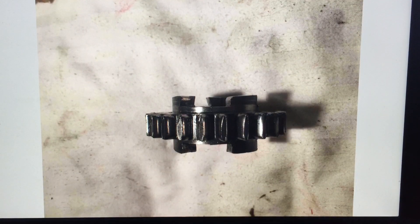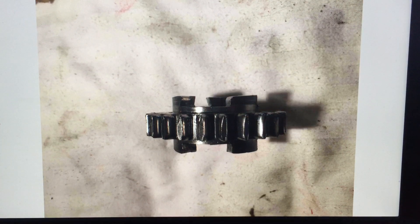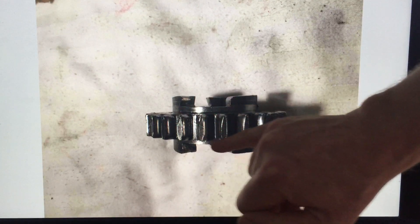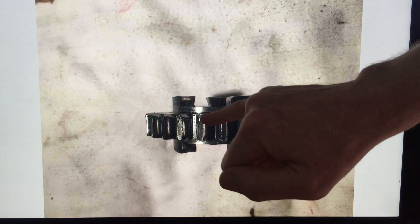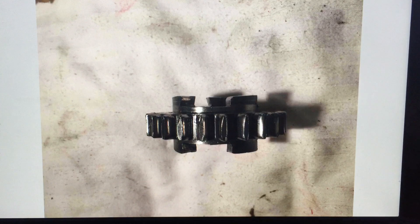That's a good photo showing the leading edge I've ground onto the dogs. This is the intermediate second gear — the one that tends to cause the most problems. It has dogs on both sides and wears quite a lot; you'll often see the teeth start to round at the edges. It would have been nice to get a completely new gear, but those leading edges aren't that much of a problem because once it's in place there's plenty of area for the gears to drive on.